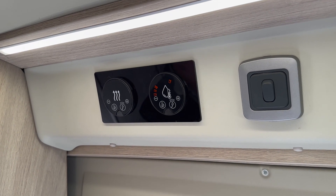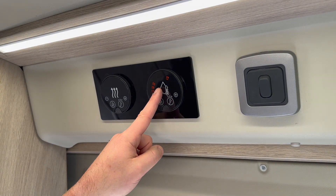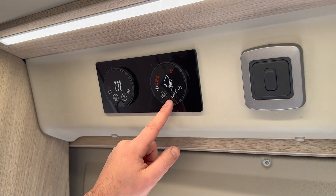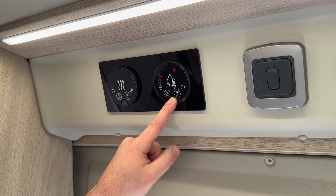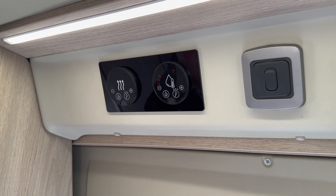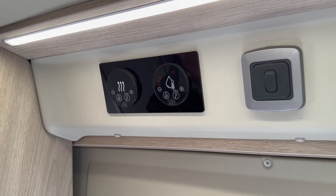Do note it will take about 30 minutes to heat up. If you do have an error code — there will be a little exclamation mark coming on either of the systems — you can just hold this button down for five seconds, count to five, and release it, and that should clear it. You might need to do it a number of times if you have let the system try to start and it hasn't had either gas or electric hook up.